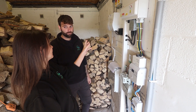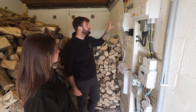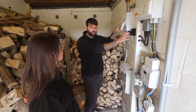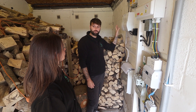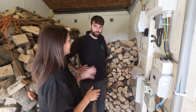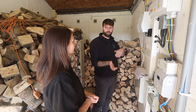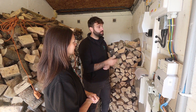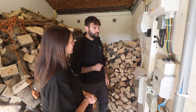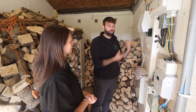The EPS boards mean that in a power cut situation we can still power some electricity. On L2 we've got gates and outside lights, and on L1 we've got lights and sockets, so they can still be on during a power cut. An important requirement when fitting an EPS is that any dedicated boards or manual changeover switches will need a separate earth rod — an earth stake — which we have behind the barn here. In a power cut situation they could cut the earth, and obviously you still have live appliances.